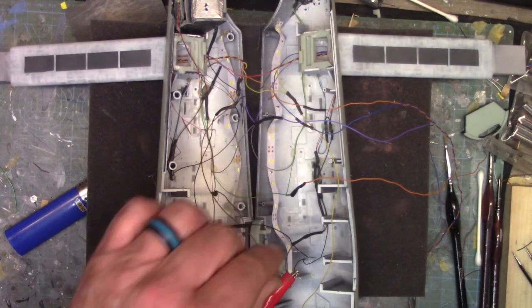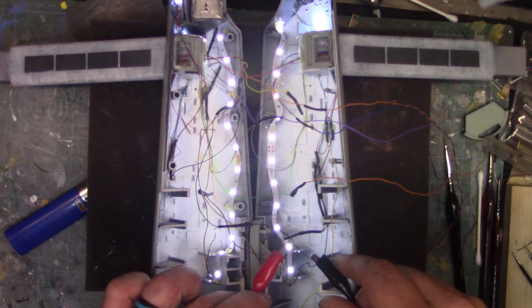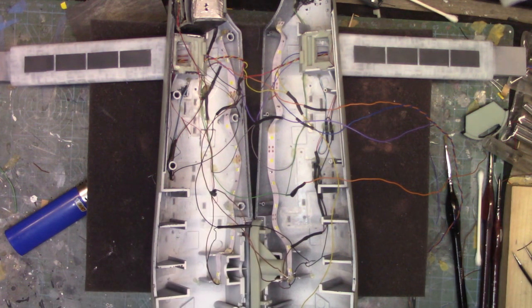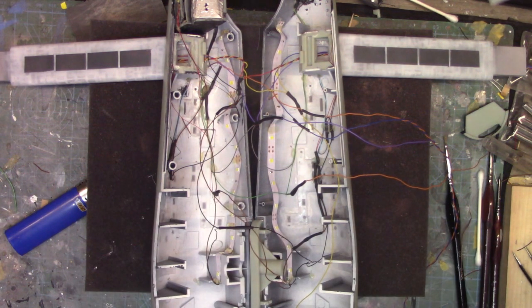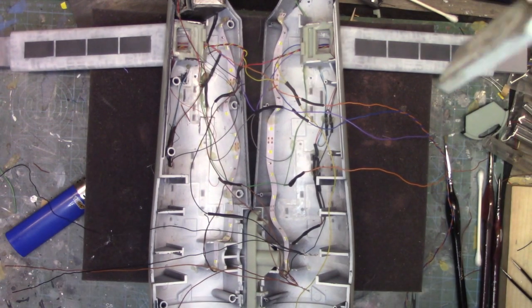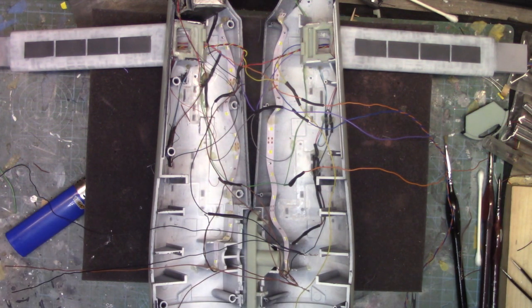Okay, I got it figured out - easy fix. I'll test, and voila - light! Now that the light is on and working, I'm going to start training some of these wires to where I need them to go. I'm running two of the power lines up to the saucer and two down to main power in the base. There is a lot there but I'll get that squared away. I want to make sure there's a good amount of solder in there to make sure everything is connected - I've thought it was a good solder job before and then tested it and got nothing.